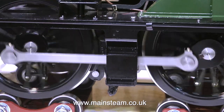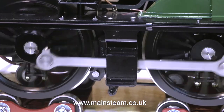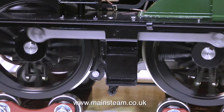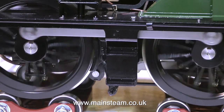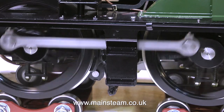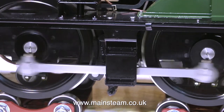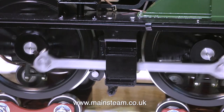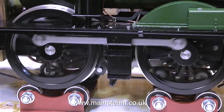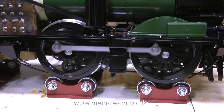To be doubly sure, I'm running the engine at a nice slow speed just to make sure that there's nothing fouling anywhere on the system. You'll see the engine start to wobble about — that's because I'm putting a lot of pressure on the top of the engine to simulate the boiler and the tanks being full of water, and also rocking the engine from side to side to simulate it going down the track. And as you can clearly hear, nothing is knocking, which is far better than it was originally. So that's about it for this episode. As usual I'll leave the engine running for the closing part. Thanks for watching, and I hope you found it useful.